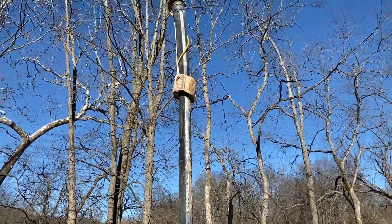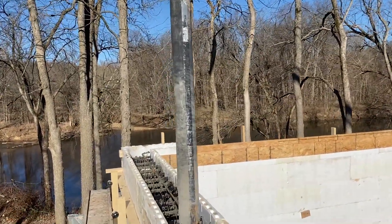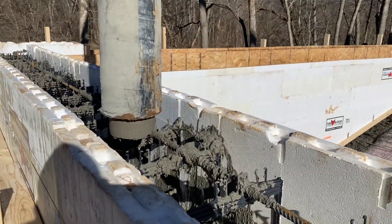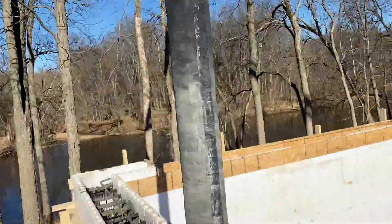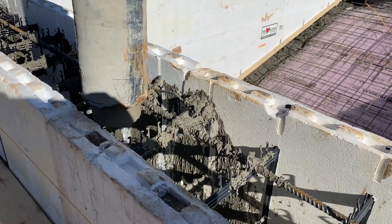This is a cool little thing — they've got this air coupler on their hose that can shut down the concrete in a second, which is part of the control I talk about with good pump drivers. It's so good that we're pouring out of the hose and look at that dingleberry of concrete hanging because of the suction that thing creates. Instead of letting all that concrete dump in where I may or may not want it, it literally stops it. I could shake that little bit out, but that's pretty cool.